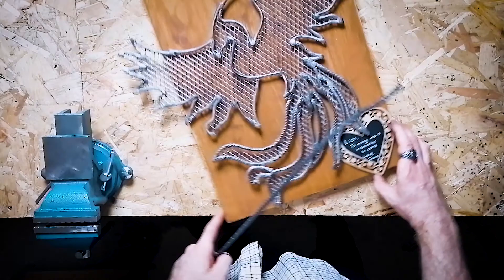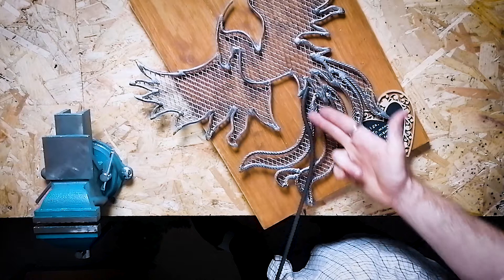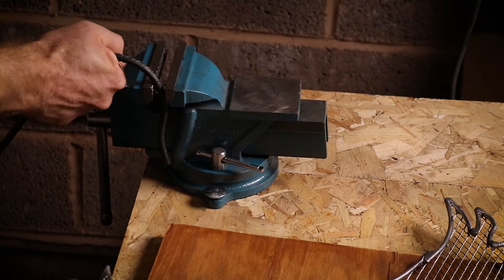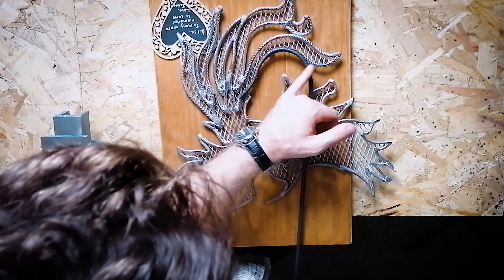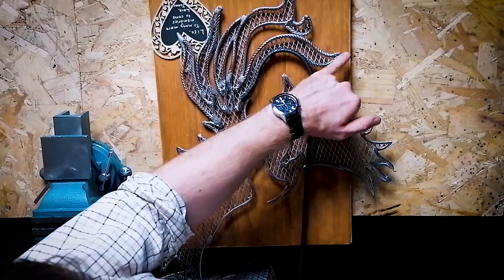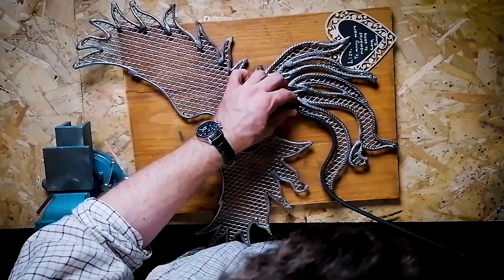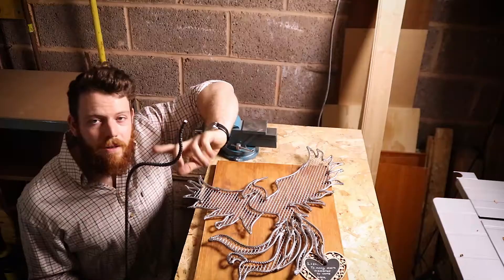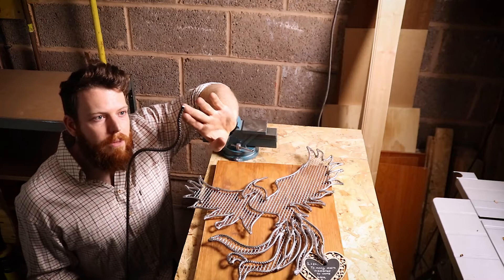You do need quite a lot of space to do this because you're maneuvering quite a large piece of metal. You can see that bend has started to occur in the other direction. We've pretty much got to the point of our next curve now, so we need to start bending it back in the other direction again - clamping here, bending that bit back straight and then starting to curve back. That's pretty much it. Obviously it's not a perfect representation, but that's the sort of accuracy I'd be going for if I was making this based on a drawing. Now there's one last thing I want to show you: how to get really tight radiuses like this right angle here, which you're not going to be able to achieve just by bending by hand.